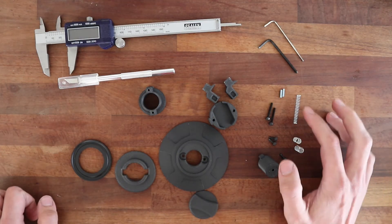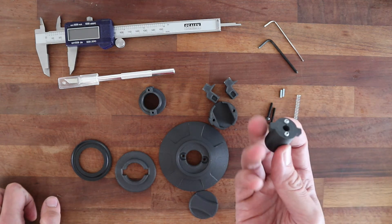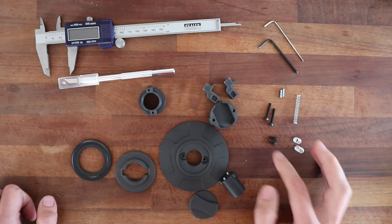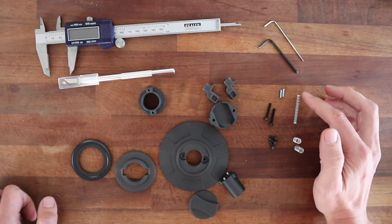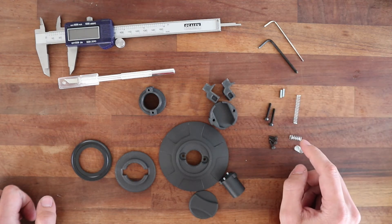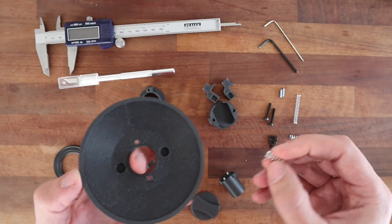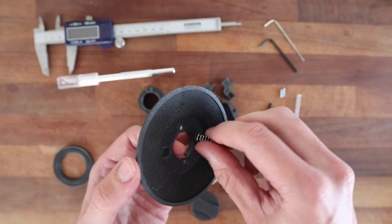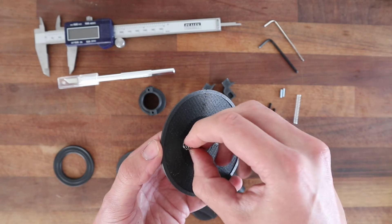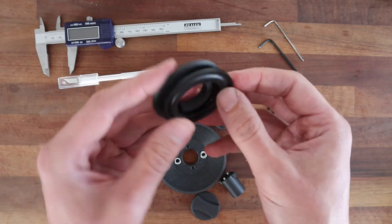To put this together I'm using these — these are all 3mm. These are 10mm grub screws for the key. And then there are some M2x20s and three 8mm screws. There's a 30x5 spring to tension the poles, and then these are 7x12 springs which tension the rubber gasket onto the tank. So these go onto the underside here, and the rubber gasket onto this.